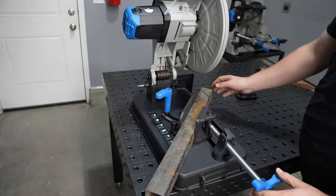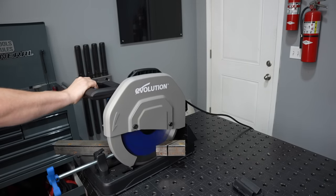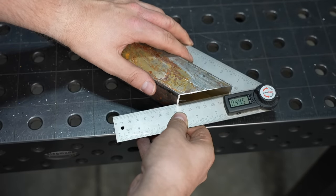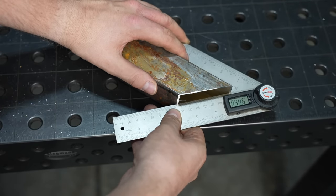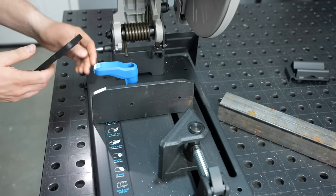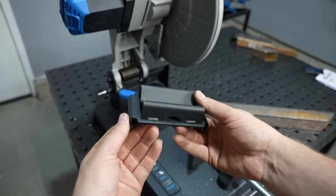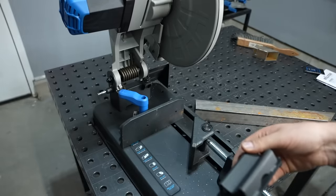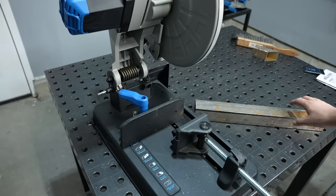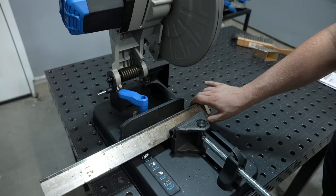The other reason you'd move the fence to different positions is to avoid having the blade run right against a flat surface, because that wears on your blade, cuts more slowly, and generates a lot of heat. You want it positioned so it's cutting vertically to some extent — I generally position it right up towards the front and that works well. Once moved to the front, it cut really well and that's a pretty accurate cut — good enough for most fabrication. You can fine-tune it by sliding the degree indicator. There's also a block to position material at 45 degrees for straight cuts on square tubing.